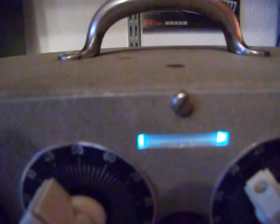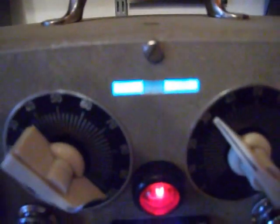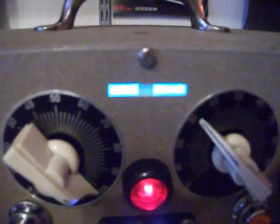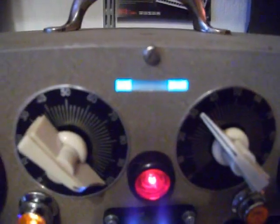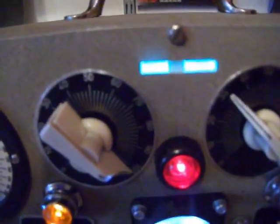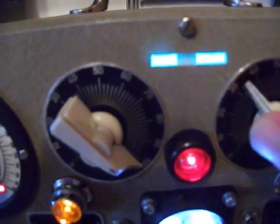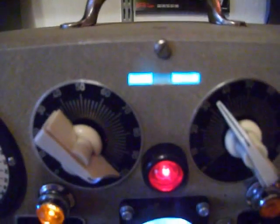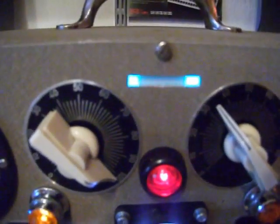Raise the ratio — compressor is acting, and the detector signal gets lower. This is how feedback is working. If you increase the input, the compressor behaves more like a leveling system, not really as a compressor.